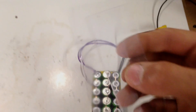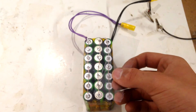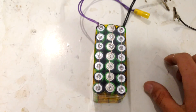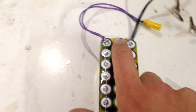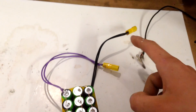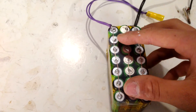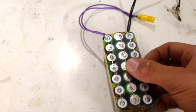I've got two plastic pieces here that will go over the top to give it a layer of protection and prevent any shorts from occurring unless the two terminals connect together. Just going to put that on there and then wrap a layer of Kapton tape around it.